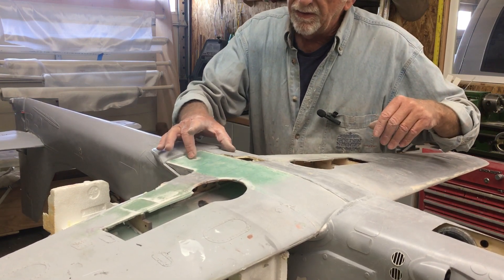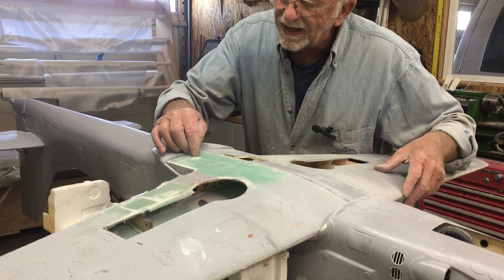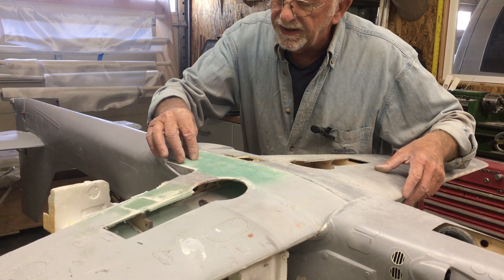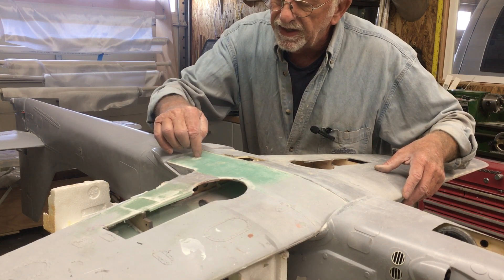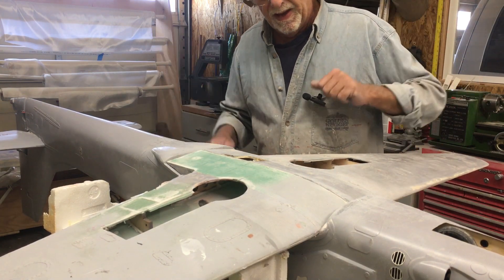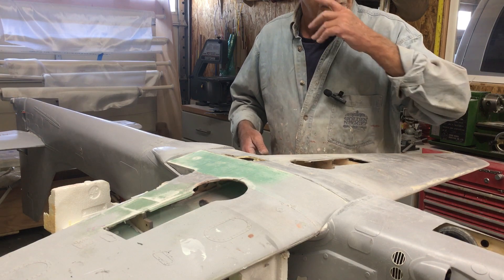With the bolts, I realized I had to do something, so I'll laser cut some quarter-inch Lexan and glue it into the mold permanently. That will give me basically a quarter-inch deep recess once we lay up the wings. I also need to redesign the back spar so it comes right across the back side of the wheel well, which will get it out of the way so everything fits. I'm real happy - everything's working as planned.